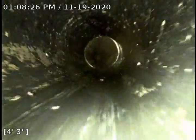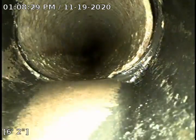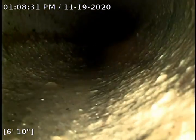This is Mickey with Absolute Drain Service at Meadow Springs. You want a sewer line inspection. Just clean this line up a little bit. We've got a short piece of ABS, and it looks like we're going to switch to an asbestos cement pipe.